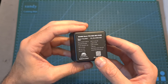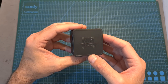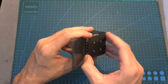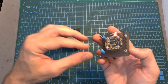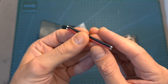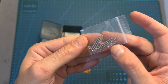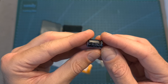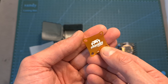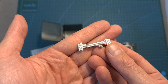In this video I'm going to go over the features and specs of the stack, bench test the motors using Mamoto's thrust stand, and then after assembling the motors and stack on the Diatone F4LR frame, head outdoors and test them out. First let's start with the Mamba Basic F722 Mini MK3 stack. In terms of packaging, the MK3 stack comes well protected inside a plastic case, where along with the stack you can find silicone grommets, rubber o-rings, 6cm long 16-gauge battery leads, an XT60 battery connector, 5 extra Philips M2 screws and 6 plastic nuts, a 35V 470 microfarad capacitor, an anti-interference shielding accessory, and an extra 8-pin JST harness for connecting the flight controller and 4-in-1 ESC.